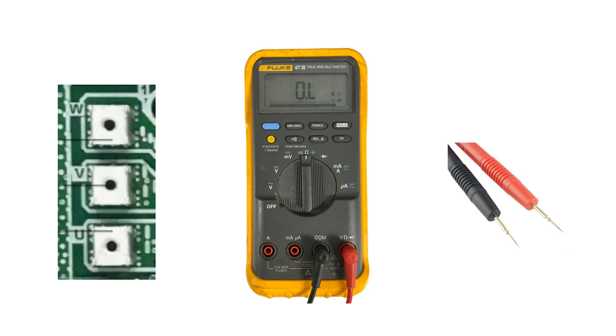In the case of a blank board, turn power off to the outdoor unit and wait 1 minute and remove U, V, and W wires from their terminals. Turn the power back on with the wires hanging. If the board lights up, the fault lies in the compressor.